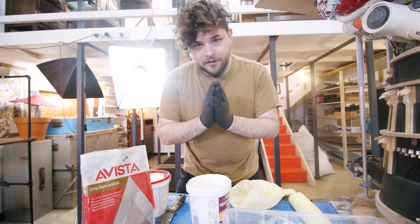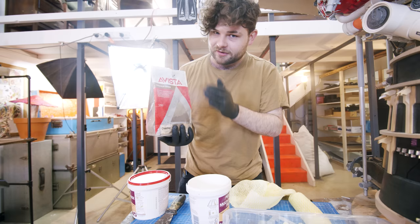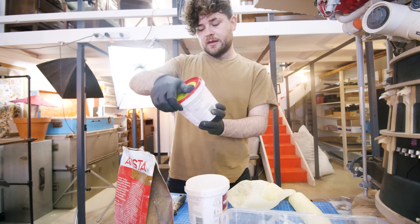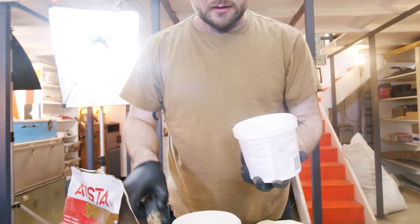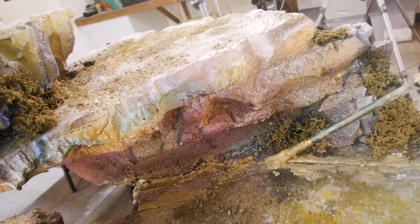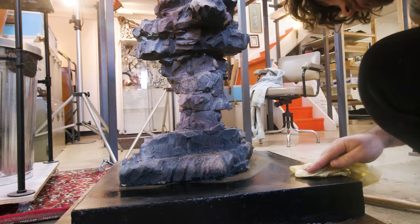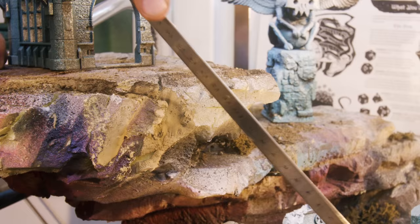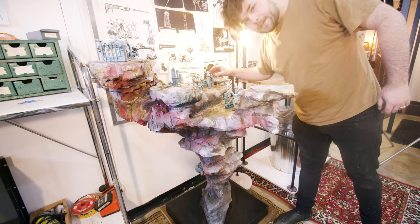I really want to avoid having to paint my repairs as much as I can, so I'm going to show you a trick. This is coloured oxide — this is what you use to stain concrete or grout with. You only need a tiny little amount, and we're going to use some multi-purpose filler. This stuff is a powder; you add a little bit of water to it, you don't need much, you mix it up, it turns into a paste. This is the filler that we applied earlier, and now we can smash it up to blend it all together. Balance restored — everything is fine.